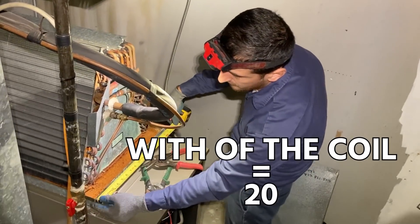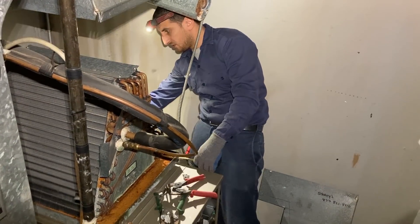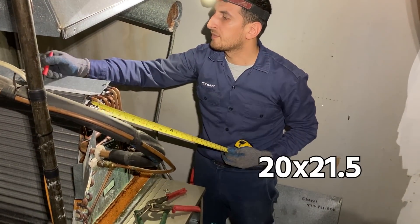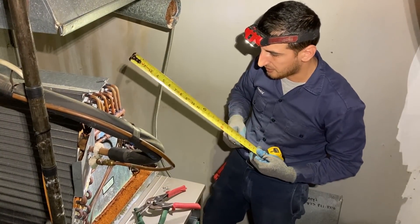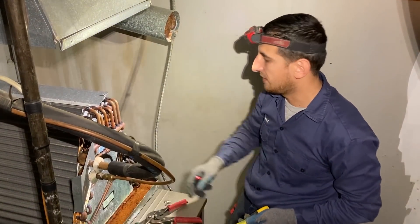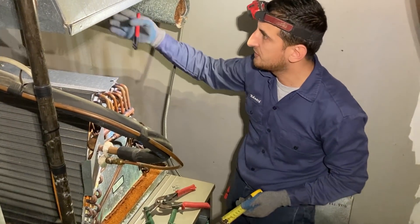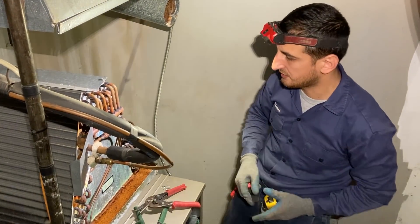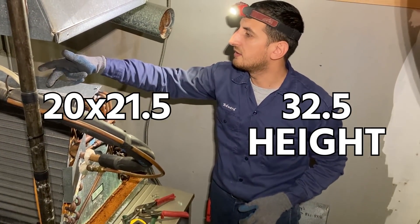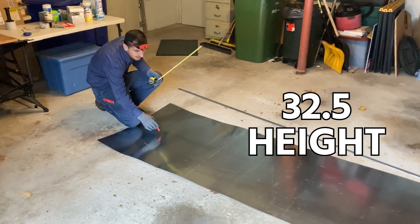My width of the coil is 20 and it is 21 and a half. So our box will be 20 by 21 and a half, since we have 21 and a quarter, and we'll screw that in. We're gonna build this from just two pieces, exactly the way it was — one piece in the front that will act as a door, and a U-shape from one piece. Screw it in first, then put the door on. We have all the sizes: 32 and a half high and 20 by 21 and a half.